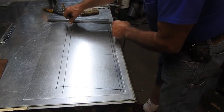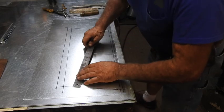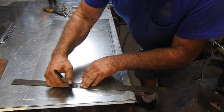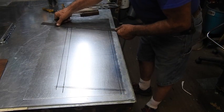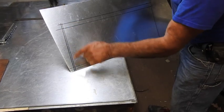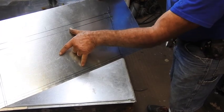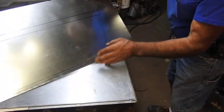Now from that point on the one-inch-down line, you can put a mark at 21 inches. Connect these two dots from your three-quarter double hem up to your drive line — that's your angle for the back end of the furnace. Then up here you've got your 21-inch mark, and we've got our 20-inch mark here. Connect those two dots. Then you can go ahead and add a quarter of an inch — you can just kind of estimate that, because it's got to go inside the Pittsburgh lock so three-sixteenths is fine; the Pittsburgh's going to lock it anyway. Add a quarter of an inch on the other side, and now you can see the tilt of the fitting. So let's cut that real quick.